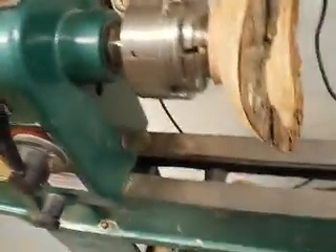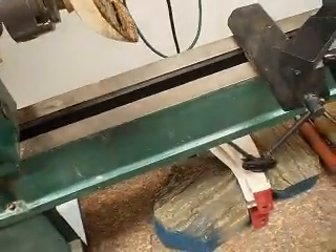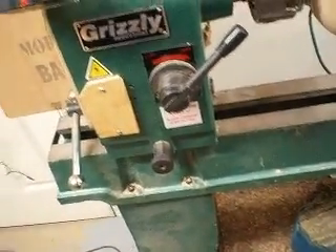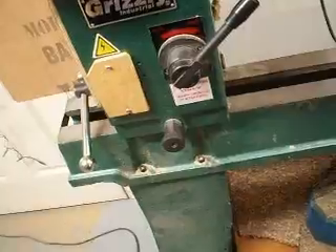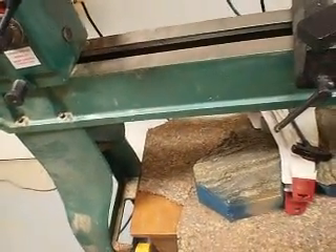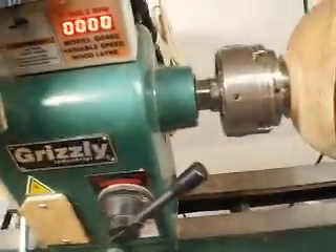The modifications are really easy to do. It took probably five or six days, off and on. I got the treadmill apart on a Thursday and had it mounted on the lathe by Saturday. Then this weekend I worked on making the pulleys — that was a lot of work. I wanted to make them strong enough, so I made them out of Baltic Birch plywood, which has a lot of plies and is very strong.